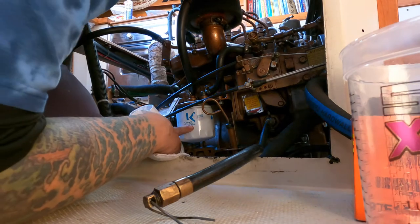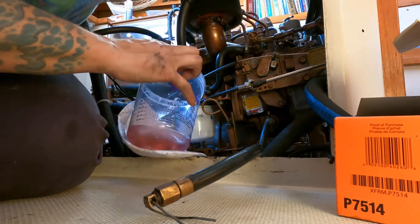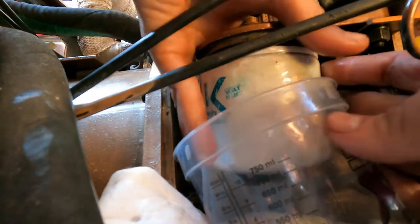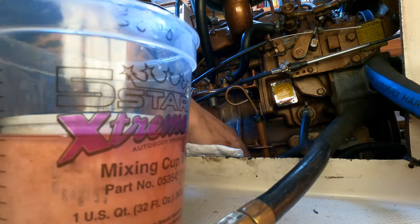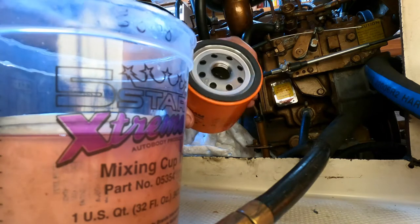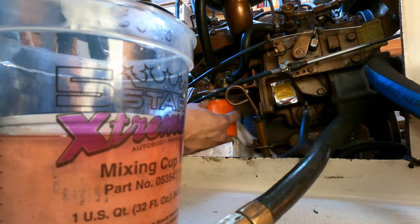Here is my secondary filter. I've got an oil absorbent cloth underneath and I'm going to use this bucket if I can fit it. So once it's done dripping, you can pull that bucket out, still have the bilge cloth in there catching those drips. Take your new filter, and before you install it, it's a good idea to make sure it's going to fit.